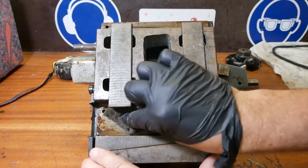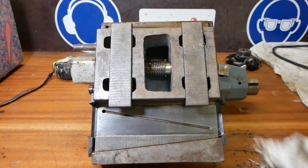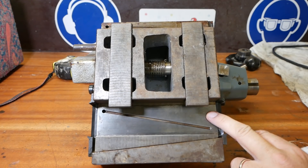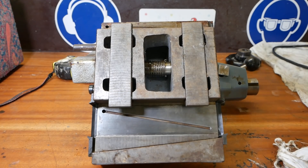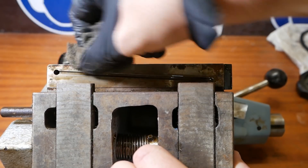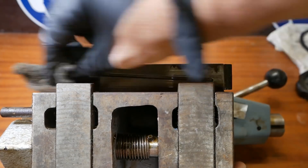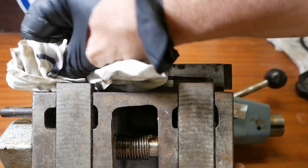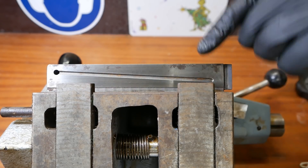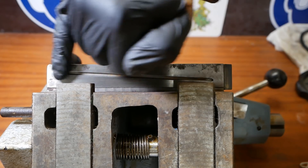So what do these gliding ways look like? Well, there's only a bit of either surface rust or a bit of oil on them — cleaning up easily. On this one there's no sign of scraping marks, but I don't know if it was a ground surface or a scraped surface originally. There's definitely a little bit of rust on these ways, but it's only surface. Looking at them, there's definitely no scoring and no obvious wear, so I'm guessing that they were probably ground from factory — looking pretty good.